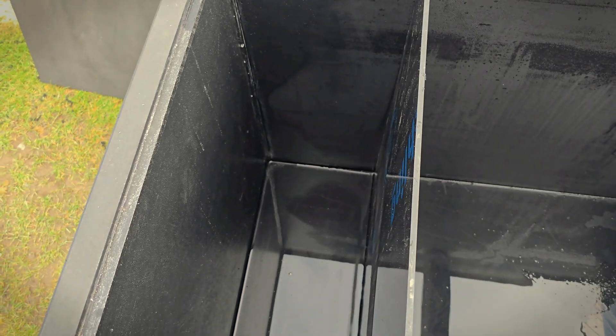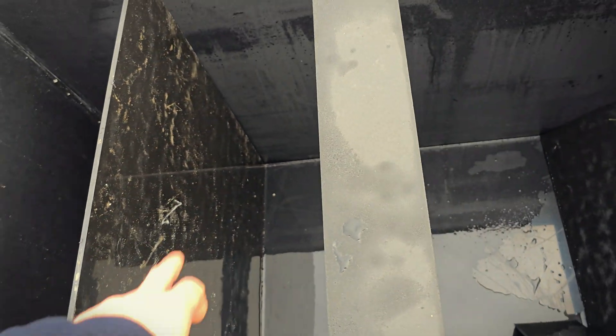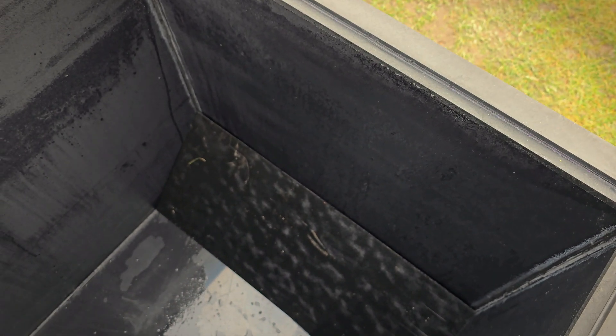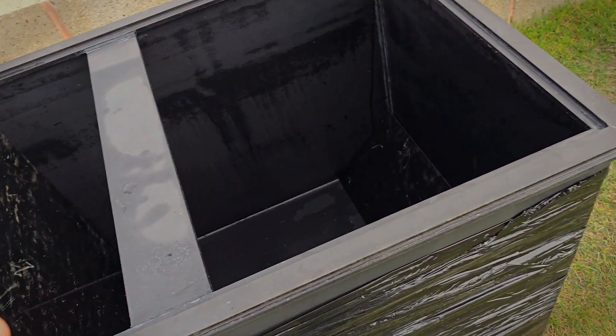This is roughly where I'm going to put the divider. I've got to do some measurements and once I'm happy with it, I'll get it tacked in place and get some holes in it to suit the required amount of flow. The number of holes has got to match the surface area of the four-inch inlet so it doesn't restrict any flow. Same with the outlet down here — that bit of plastic is going to have a load of holes drilled in it, matching the surface area of the four-inch pipe to avoid any flow restrictions.